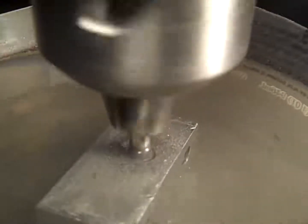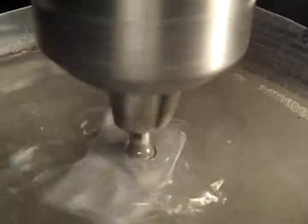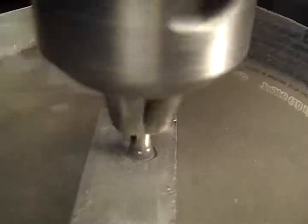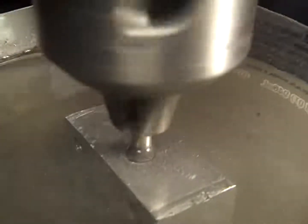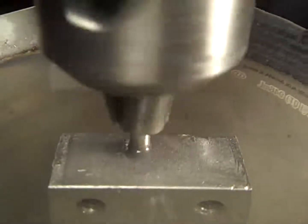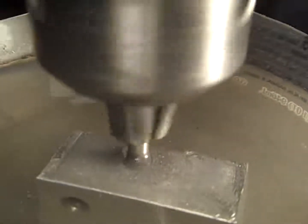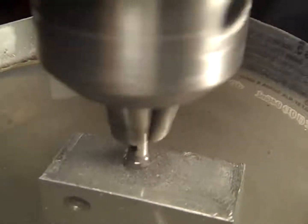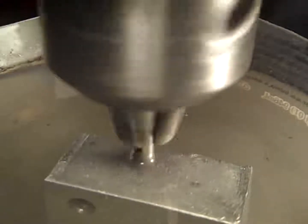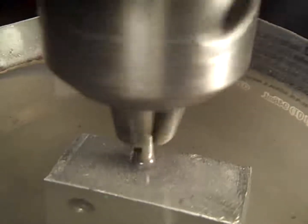But, yeah, that was a big mistake, breaking that pin off. And then, you know, I probably have 30 hours into trying to build this mold with a drill press and a mini lathe. Whoops, I converted my mini lathe to do some milling so I could mill the faces. And I might have to run it in a four-jaw chuck to bore out the holes, because the holes are bigger on the bottom than they are on the top.